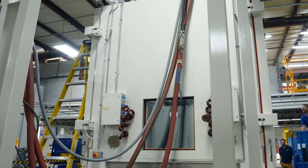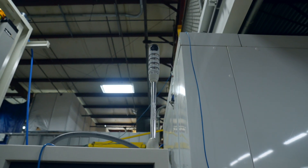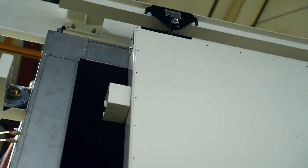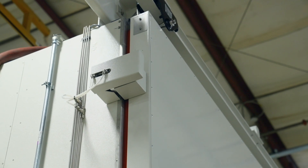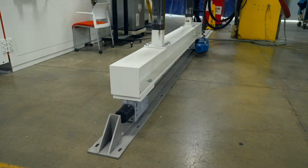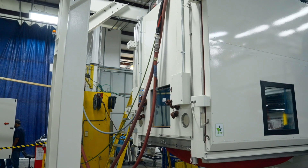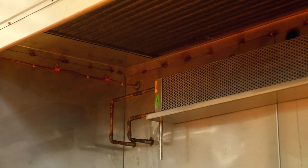With shaker tables larger than 54 inches, the entire chamber lifts up for easy interfacing with the shaker table. Dual doors on gantry designs provide easy loading and fixturing for your product. Pneumatic door latches are provided on large doors to ensure a tight seal. Optional sliding doors are also available for convenience. All chambers have tracking with casters for precise movement, along with various options like ports and cable notches for easy cable routing or ambient air blowers to purge the chamber workspace and vent any vapors.